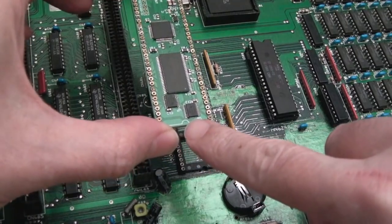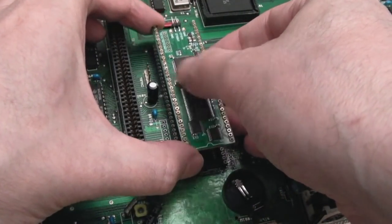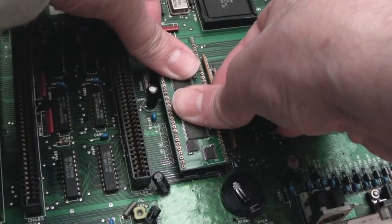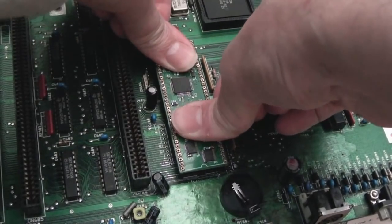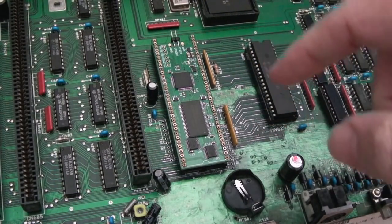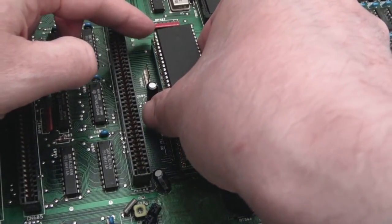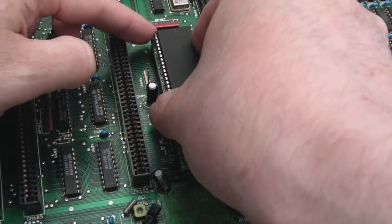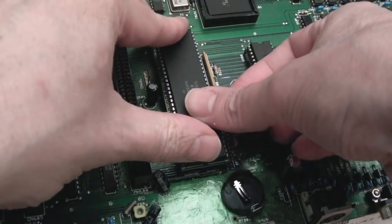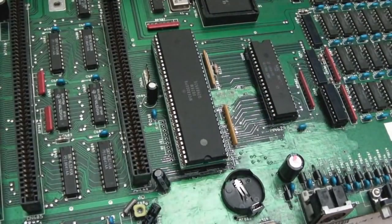You can see the pin 1 marking here, and the pin 1 wants to go down there, so let's just connect that up there, like that. There we go. I've chosen this board first because you could see it had the turned pin socket, which means that when you stick pins like this in, you've got less risk of damaging your socket. The pins on this seem pretty thin though. Is that going to go in? Yeah, there we go, that's in. I'll switch it back on.